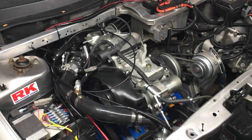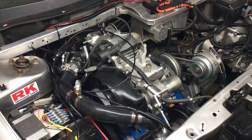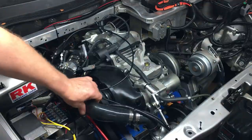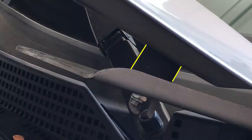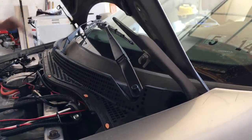Let's see if the car will even run — it's been a while. The induction pipes didn't collapse, and we took out the reinforcement tubes we installed in the previous episode. With the double throttle bodies, all the vacuum is behind the rear throttle body, and that's completely normal. We have the system set up to allow the supercharger to provide a tiny bit of positive pressure to the induction pipes at idle. Overall, the twin throttle bodies work as expected. For the meth injection system, we'll need to head out to the Hillbilly Proving Grounds. This week in Kansas it's suddenly hot — in the 90s. Before taking the car out for testing, we rigged up some hood spacers to allow additional airflow under the hood.